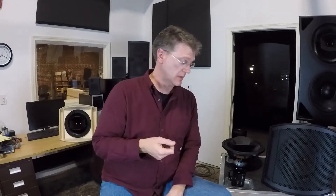It also makes a more reliable product. The parts that generally fail in a passive loudspeaker are the resistive parts because, as the loudspeakers are in use, they heat up and cool down and heat up and cool down. Eventually that's going to break, but also as they heat up, their values change.